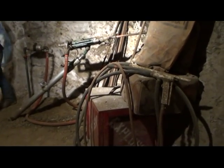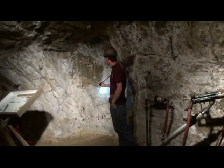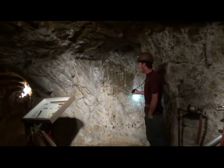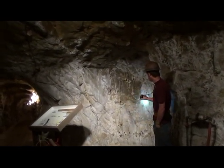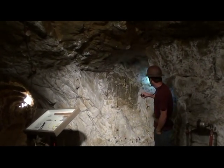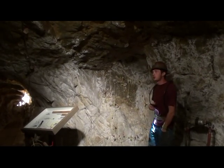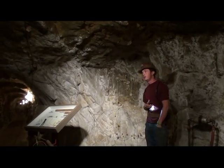Now our center hole, this is just known as our relief hole. It's just for the expansion of the rock. Now your first blast to go off is your 4-hole burn. Second is your box. Third is your ribs and your knee highs. Now those are the only 2 blasts in this entire sequence that's going to go off at the same time.